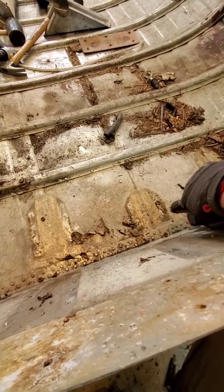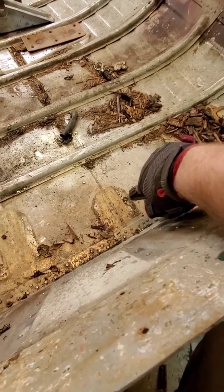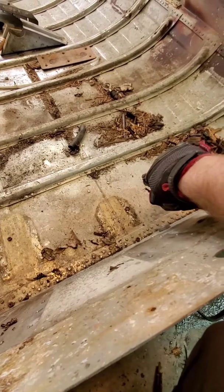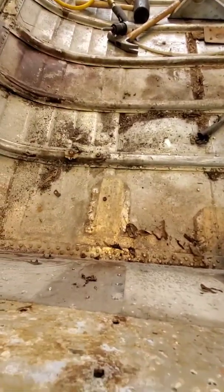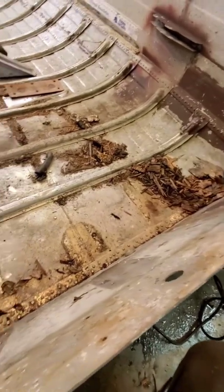What I'm going to do now is clean this whole thing out, then go over these rivets starting here in the bottom. This piece is going to be gone anyway, so I'm going to practice and see if I can TIG weld and melt those rivets - basically weld them to the boat and fill those holes at the same time. I'm doing it there because that's the part of the boat that's going to be missing - I'm going to cut that out for the intake. It'll be a great place to practice and see how welding on this boat is going to work. It should be really fast and easy.